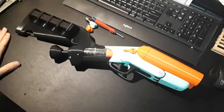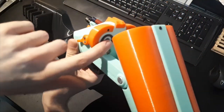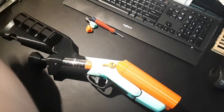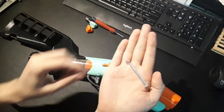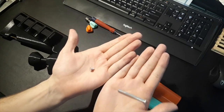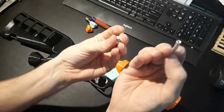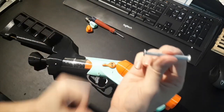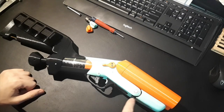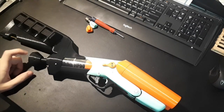Before you even start printing stuff, you should know there are a couple specialty pieces of hardware you need for this blaster. There are a few specific sizes of O-rings that aren't exactly common — on the plunger tube and the bolt face. There's also a 2-inch Chicago bolt, which I had to order online. There's also a spring for the ejector trip that you'll have to bend yourself, and I'll include a clip at the end of this video showing how to bend it.